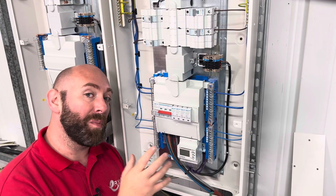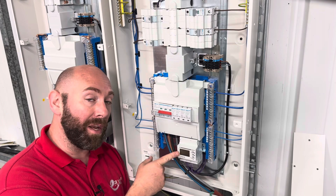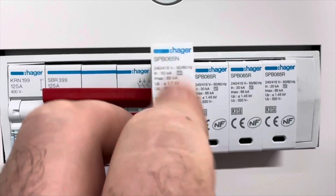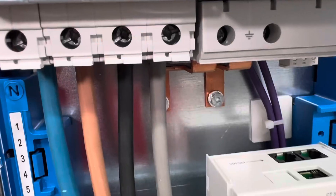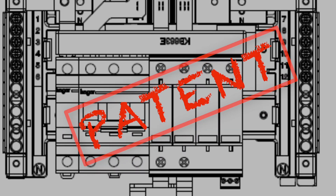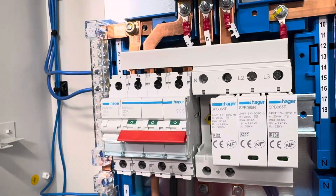I'm looking forward to seeing this working when the electricians are fully finished. But they've rigged up a temporary supply so we can fire it up and see this MID meter working. But before that, let's go into some of the features and benefits of the 125 amp power and lighting distribution board. First off is this tasty-looking surge device. The busbar comb connects into the top of the main switch, then over to the SPD, with the earth connection at the bottom — it is a really solid unit. This earth connection is an industry-leading patented design by Hager. Already best in class, this Type 2 does not need secondary upstream protection, and if a surge occurs the device unplugs, ready to be replaced.